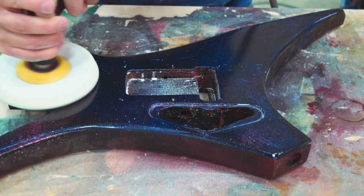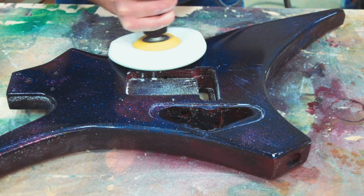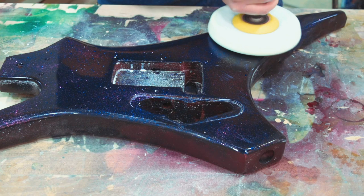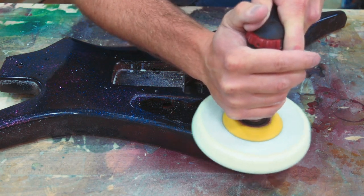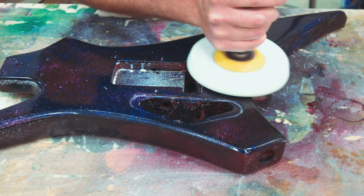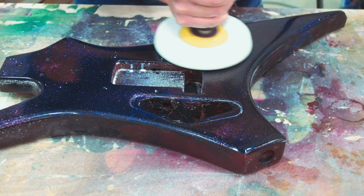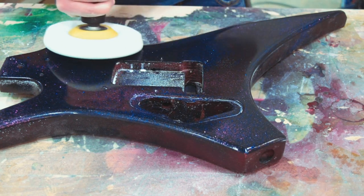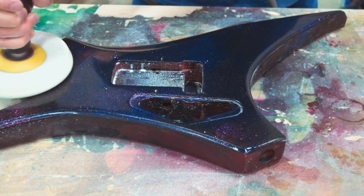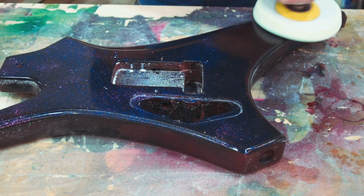With some things you'll want to move a little faster, like a lacquer — it's a little softer, so you won't want to stick around in one spot too much. Part of the issue as well for this one is that I put that poly on there, it's catalyzed, it hardens, and I left it on there for probably a couple months before I got to this. Usually what you want to do is sand it flat and polish it about 24 hours after you spray it, and then it's still soft enough that it'll polish out more easily. That probably is a strong part of the reason why I still end up with some swirl marks — it's a lot harder to polish it out when it's hardened up that much.